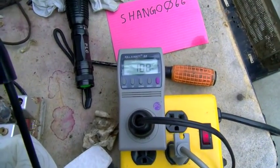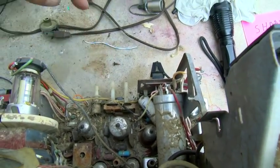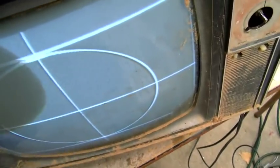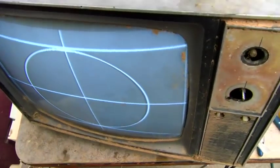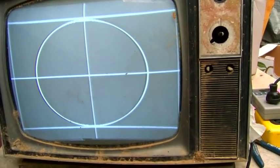Just for some reference on this set: we're drawing 108 watts. The horizontal hold control coil has cracked solder joints on the bottom of the board, so if I touch the coil it just totally loses it. All I did to this set was hose the tuner down with WD-40 — that's probably a no-no — but I didn't want to waste my good expensive $20-a-can cleaner on this thing.